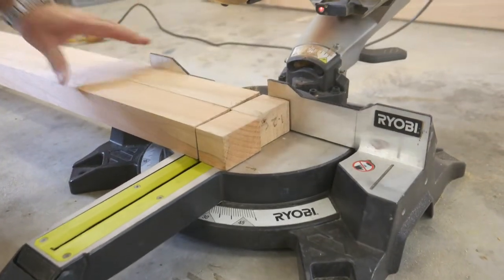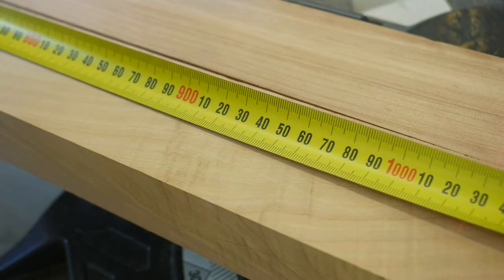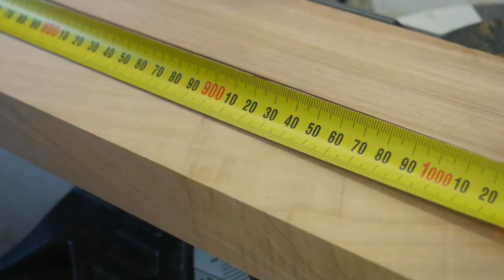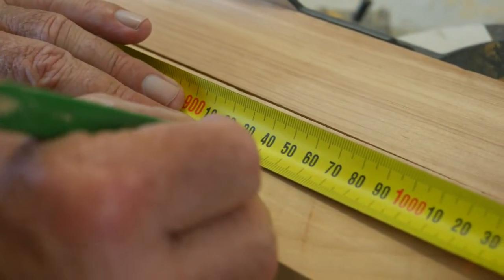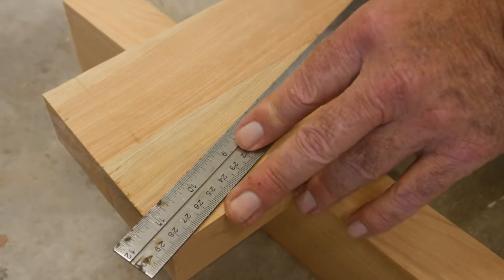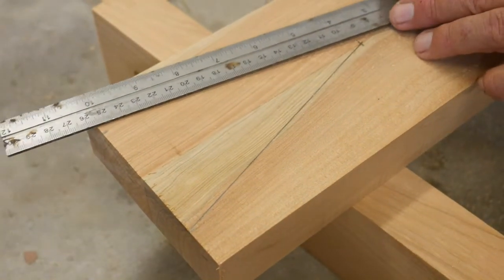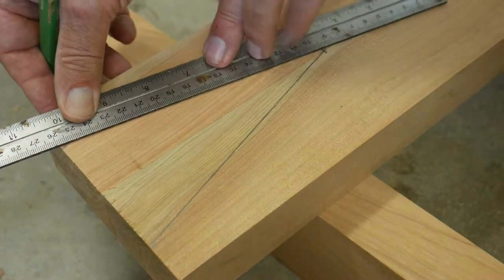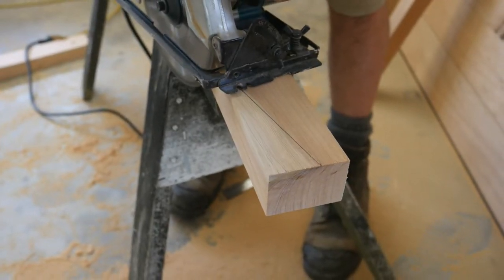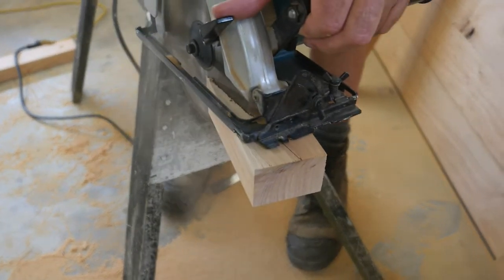Now we're cutting the legs, the actual bottom of the leg, and again following the instructions on the instruction sheet, cutting them to the right shape. It's 930mm wide, which means it's just about as wide as the tabletop, which is necessary for stability. Otherwise you'd end up with a table that might tip over. The easiest way to cut those tapered angles is with a skill saw.